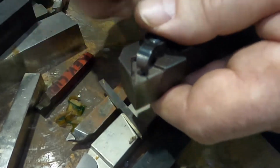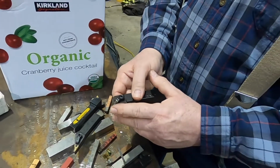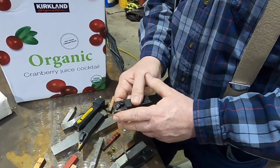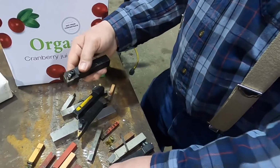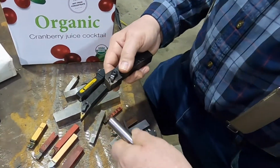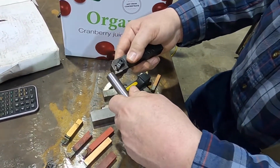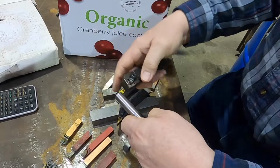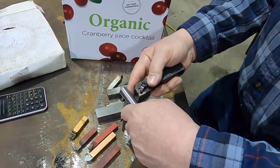You may also need it for vibration, because the larger radius is going to try and vibrate more because it needs that stability and you don't have it. If you're in the middle of a long shaft, this is 10 feet long. It's 10 foot, believe me, it's 10 feet long. And we're turning here, it's very critical, even if we're up near the tailstock, it doesn't take a lot of pressure for this 10 feet long to start vibrating.